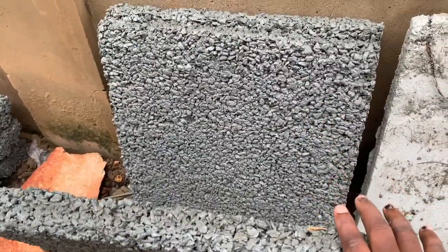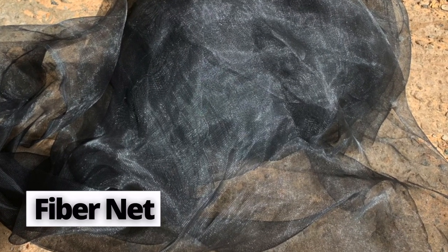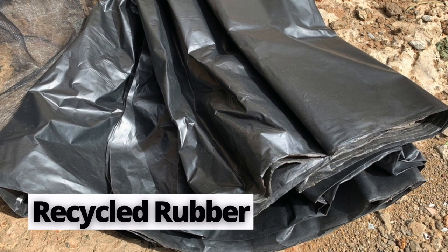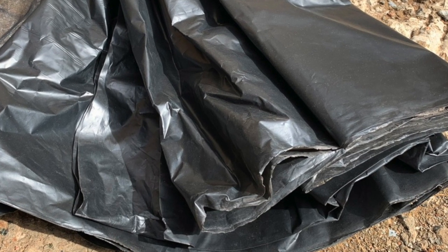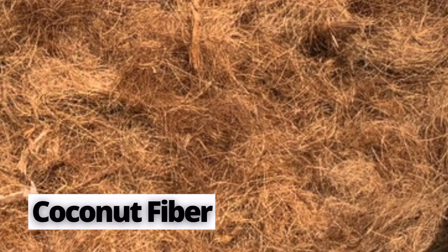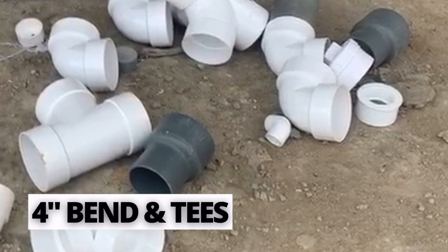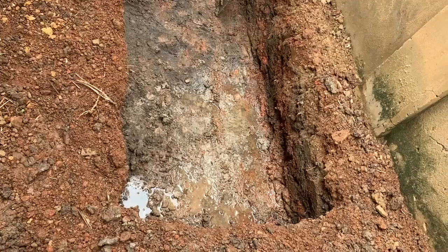Other materials needed include fiber nets for the inside, black recycled rubber for the soak away, a top cover for the soak away to seal it nicely, and top soil to cover it so the pit is not affected. The ultimate material is the coconut husk fiber, which is key for the treatment of human waste itself. We will also replace the pipes leading to the septic tank using a four-inch bend and fittings to drop into the biodigester.